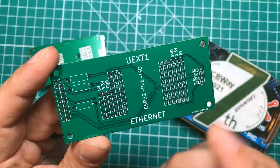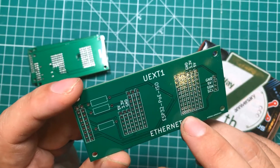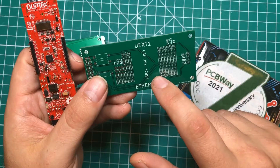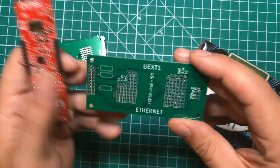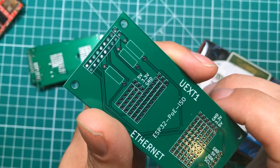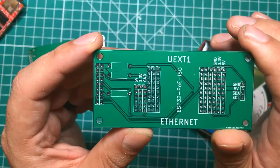I'll have the link for the 3D printing files as well as the links for the boards in the description. This PCB is so much more than just a way to mount your Olimex board. It has three rows of pins in the middle which are duplications of the pins on the board itself — one set mounts the board and then every single pin is broken out twice, which is awesome for prototyping. In addition, there is ground, 3.3 volts, and 5 volts available for every single pin, giving you extra places to hook power and ground to all your devices.